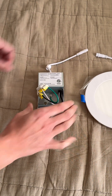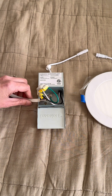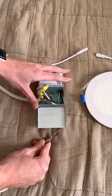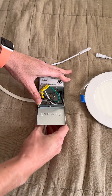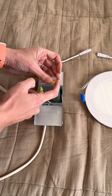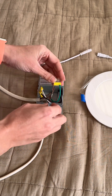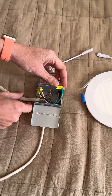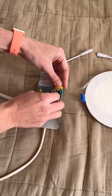For this light, we actually wire the box part. Let's pretend these are the wires coming from the light switch, and these are the wires going to the next light. I have four lights to install, so you have to wire all of those together. Instead of screw-on caps, you just stick the wire into these little holes and they all connect. Green goes to the bare copper wires.